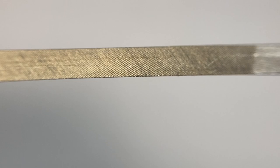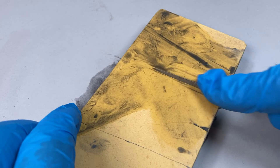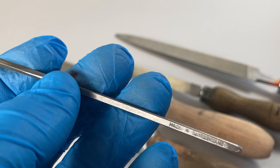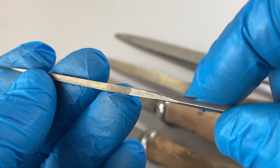So exactly the same treatment applies — I've stoned off one set of teeth altogether. Don't use an offhand grinder when removing teeth from files; there'll be too much heat, which will drop the temper or anneal the teeth and ruin the file. Always use something relatively cool like a diamond plate or a ceramic stone. Escapement files look slightly different from needle files: escapement files have square-section handles and needle files have round-section handles. Like needle files, you don't put a separate handle on an escapement file — you use it as it is.